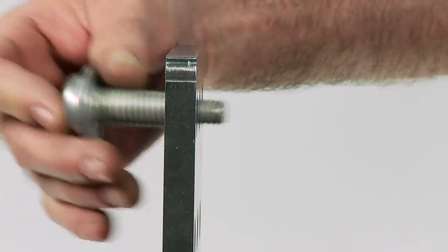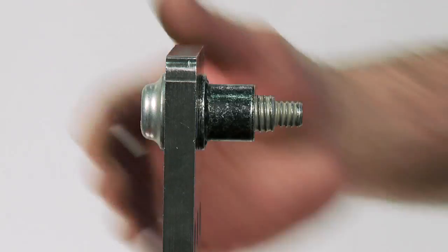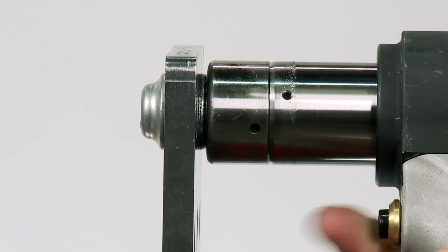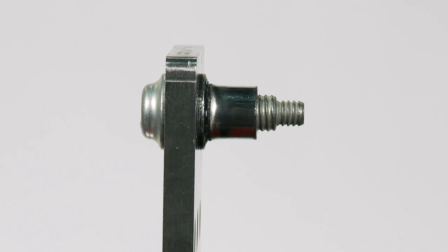With the Bobtail, we had a lot of goals. We wanted to get smaller, lighter tools. We wanted tools that held up better. We set out to reduce the installation load required to install the fastener — how much force it took to swage and compress that collar material into the grooves on the bolt. And we came up with a combination that required 30% less swage load than the conventional lock bolts.